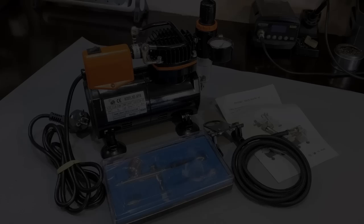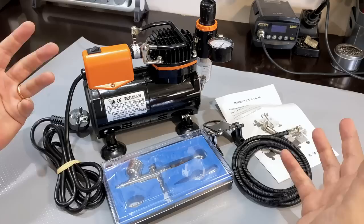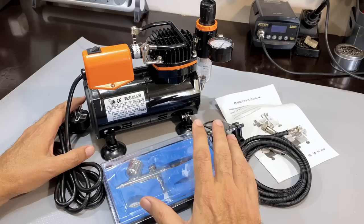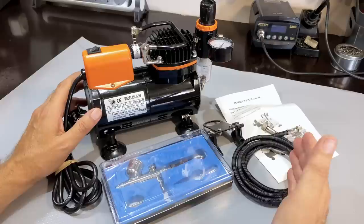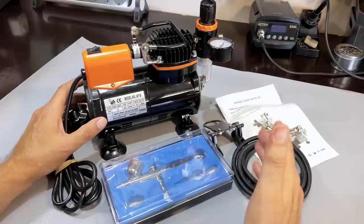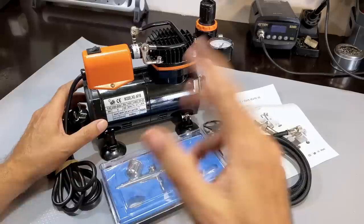When you do tube radio restorations like I do, you always find new ways of doing things more efficiently and effectively. You invent tools, invent methods — most of those inventions you just see somebody doing and start using them with some adjustments. One of the problems I've always had is when I get a chassis, I need to blow dust away. I've used a full air compressor in the past, but I had very bad luck — I blew too hard, the pressure was too high, and I messed up some coils. Those fine wires can't handle too much pressure, and I damaged them.